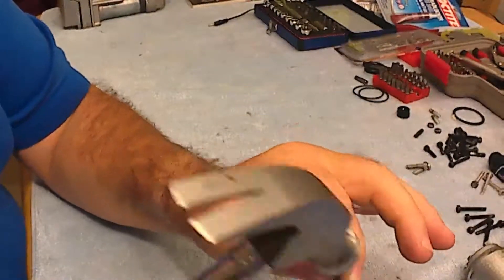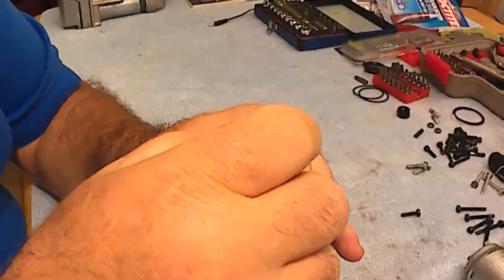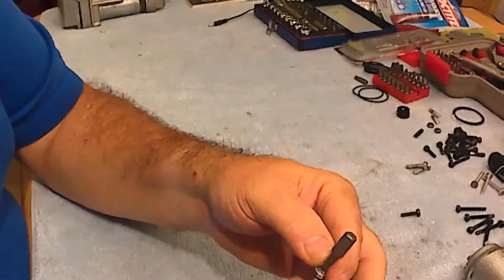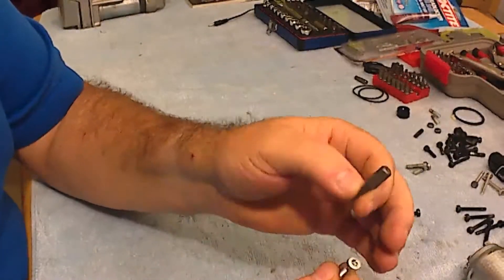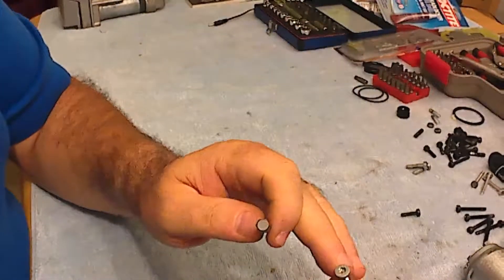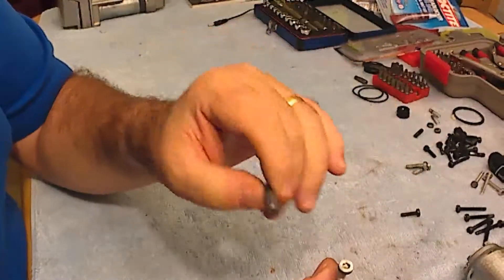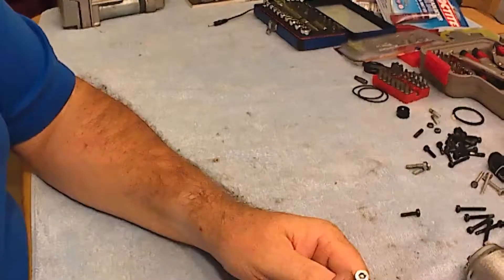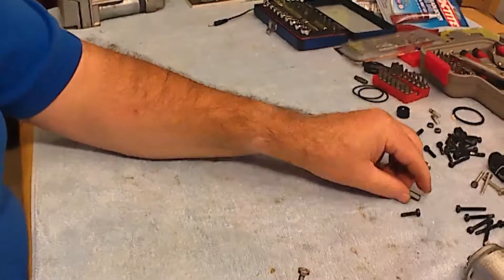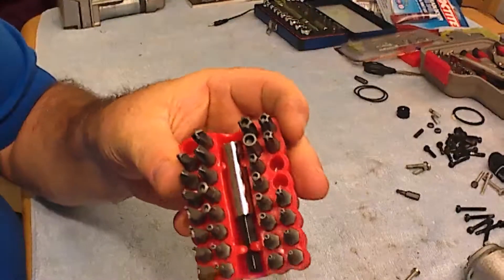In that case there is a solution — like Columbus's egg — you just need to fix the bit in the best position and then hammer it until it locks, so you can very carefully unscrew it. If you do not pay attention when unscrewing, this will destroy the torx star inside and then you will not be able to use a tool at all.